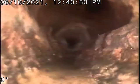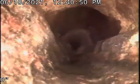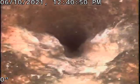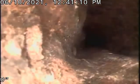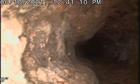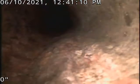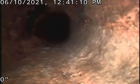That probably there is a tie-in. It looks really bad there too, but it's probably just a tie-in, a toilet, something like that there, but you see it's kind of shallow up top there. So we're just gonna keep coming back. Yeah, I see a lot of same thing, a lot of scale build up. Another crack there that you see up top.